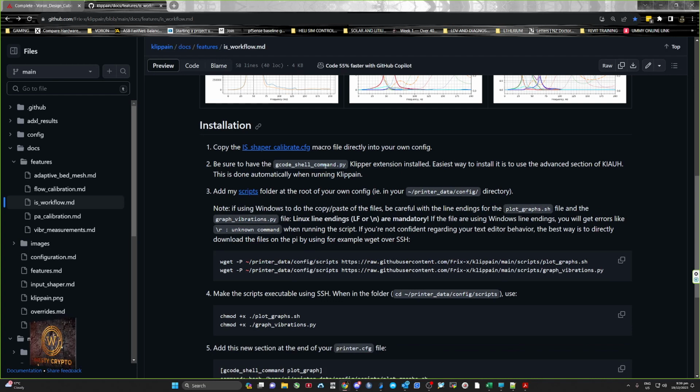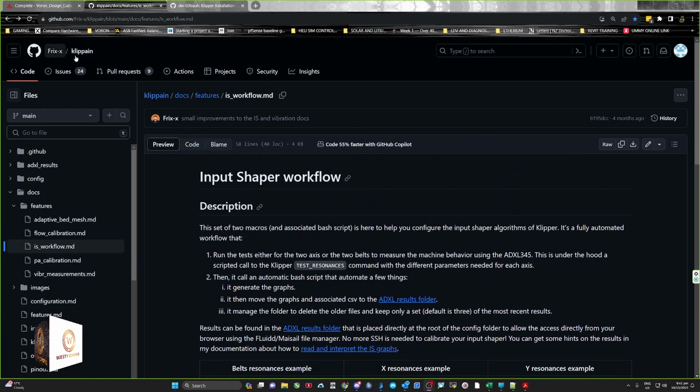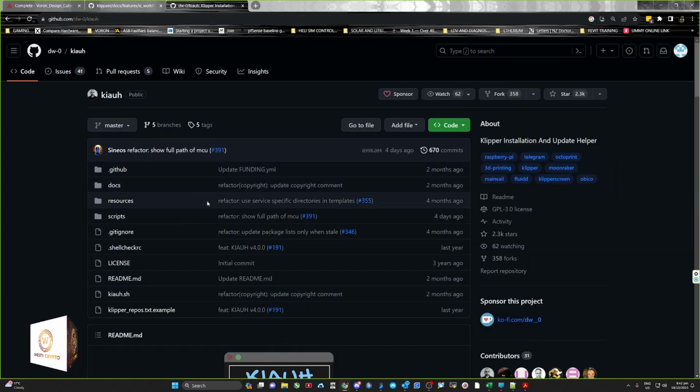Be sure to have the gcode shell command py Klipper extension installed. I didn't know what that was, and basically it's telling you to install KIAUH. And once you install KIAUH, there's an option there to install gcode shell command.py. So let me just find that. The link's in the description for the Klippain input shaper workflow, and I've also found the KIAUH installation guide in the repo.